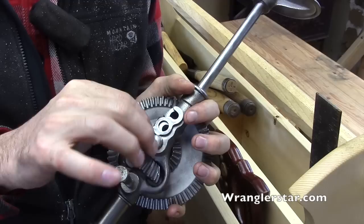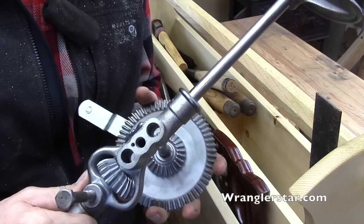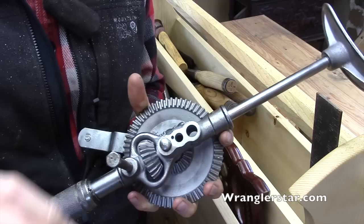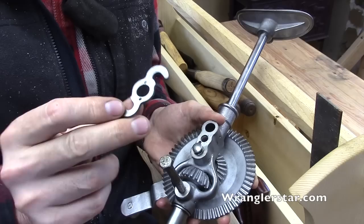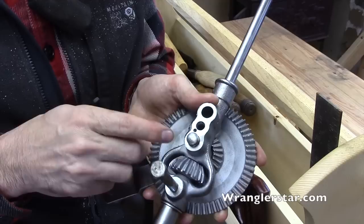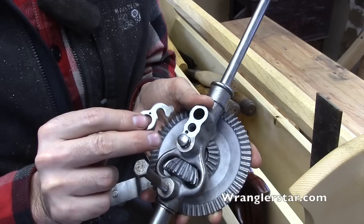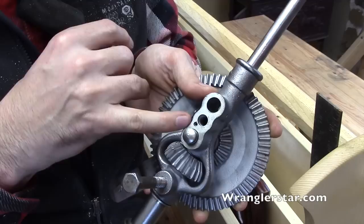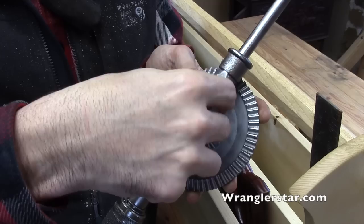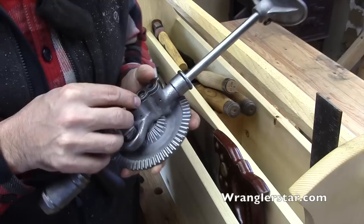Because this has to come back and forth to change the speed. Several of you said I'm not going to like having to use a screwdriver every time I want to make this change - that makes total sense. When I was polishing this I looked at it and wondered why it had two holes in it. I didn't realize there was a detent. A detent is usually a spring and ball that retains or keeps something in its place. The spring is still in there - what we need is a tiny ball bearing that will slip into that hole and hold that in position. I love detents - it's an elegant and beautiful thing.